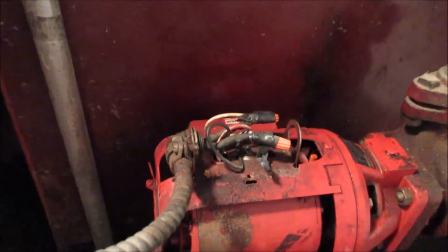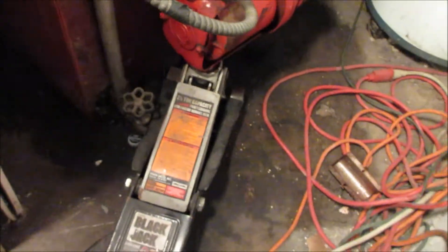That's the Bell and Gossett boiler motor that's going out. We're replacing it — this will be the second one we're putting on in about 24 years, so it's not bad. There's a two-ton jack because somebody told me the conspiracy theory that the motor sags over years and that's what causes it to not start or crank. South Chicago told me to take it in to make sure it's the right one.